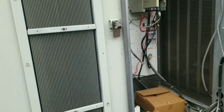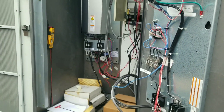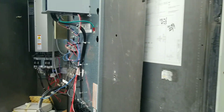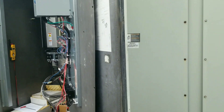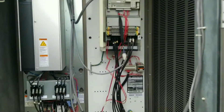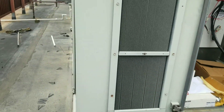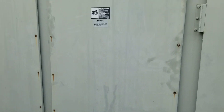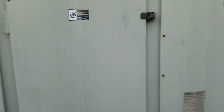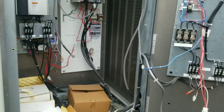We've verified that drive is the issue. I checked all my inputs and outputs - everything's doing what it's supposed to, it's just not outputting any voltage. We're going to cycle this guy off, put it back to normal on my motors, and hopefully we can get through the night with just the one motor running. Not a whole lot I can do without a drive. This VAV system is controlled off static pressure, so I can't run my motor full speed. Got to call Trane to see if I can get this drive. Maybe we'll get some video on it.